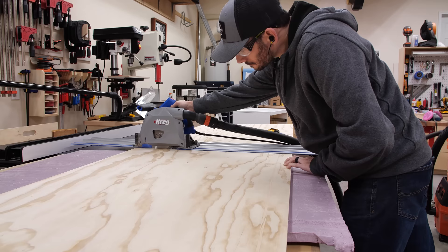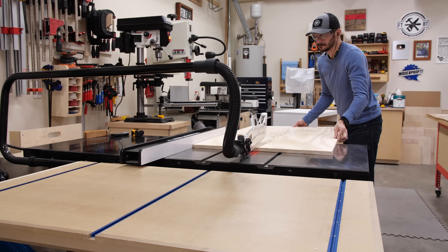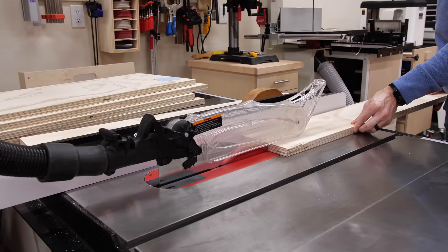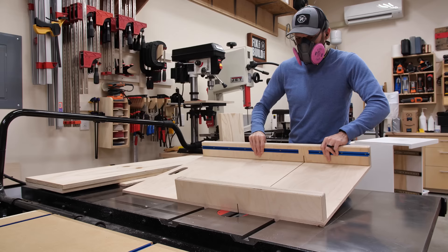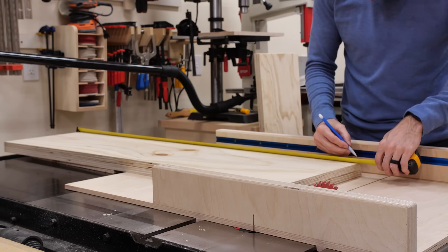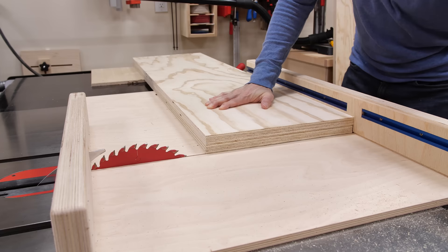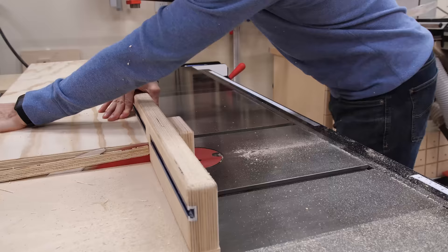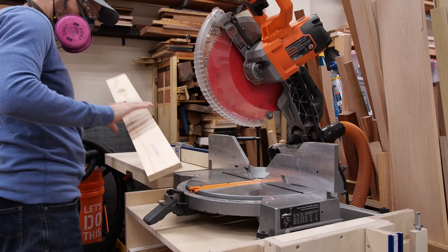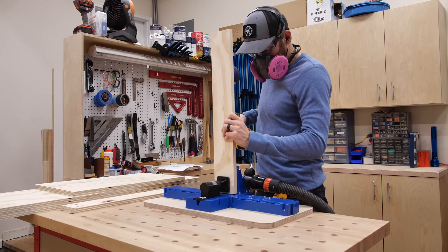The hutch is just under 4 feet tall, so I cut a full-length section in half with my track saw, then ripped the sides down on the table saw — which works much better with the blade above the table. While cutting the sides I also rough-cut the parts for the top, back supports, and three adjustable shelves. I stacked the long side panels together, flushed up the end opposite the blade, and cut both parts at once — giving me two identical pieces. The supports for the back of the hutch are similar to the ones for the cabinet, attached with pocket holes, and since they face the back of the closet you don't have to worry about plugging those pocket holes.